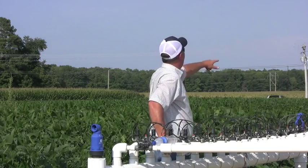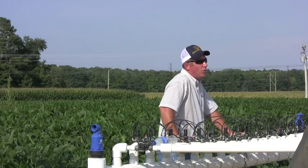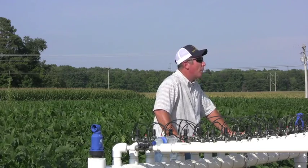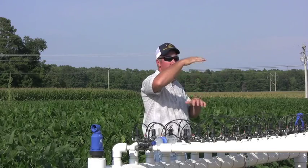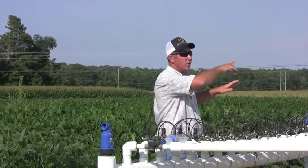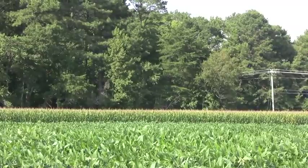Study-wise, anybody notice this little spot here where the beans are about half the height of everywhere else? It goes all the way across the field, and the corn is doing the same thing. It was a road there, and it's been a field since 1936. We show up every bit of compaction — anything that was changed in that field will show up with this system because of how it affects water moving up. Even though it's been run over with a ripper twice and then had the tape blade in it, it still shows right up that compaction. It will really show the problem spots in your field.